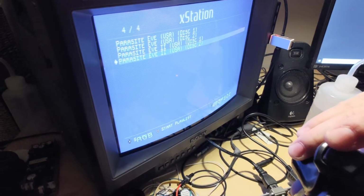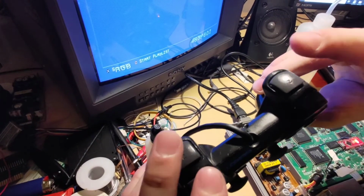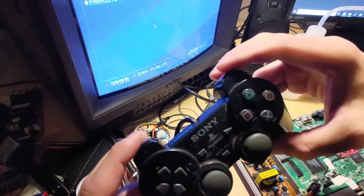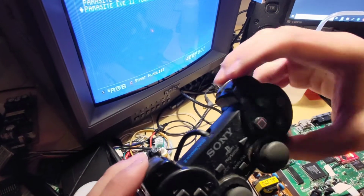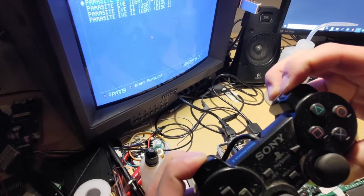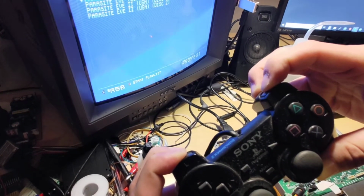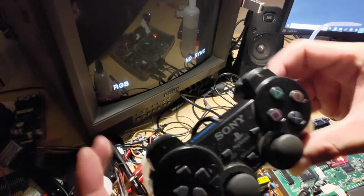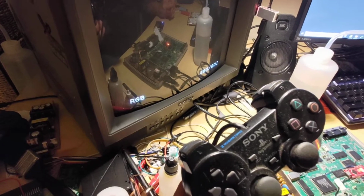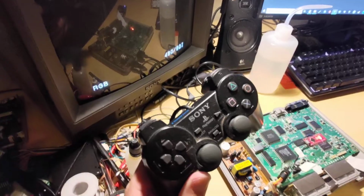But I've got it set up on this controller for, I think it short resets these 3, and then longs all 4, or vice versa. It's been a while since I looked at the source. But at the moment, I've got it set to have to hold this for quite a while. You can adjust that. It's just to make sure you don't accidentally press this combination of buttons in a fighting game or something and trigger a reset. But yeah, there it goes. It's reset. So yeah, cheap way to do a dual region and in-game reset. Arduinos are only a few bucks. But yeah, that's it.